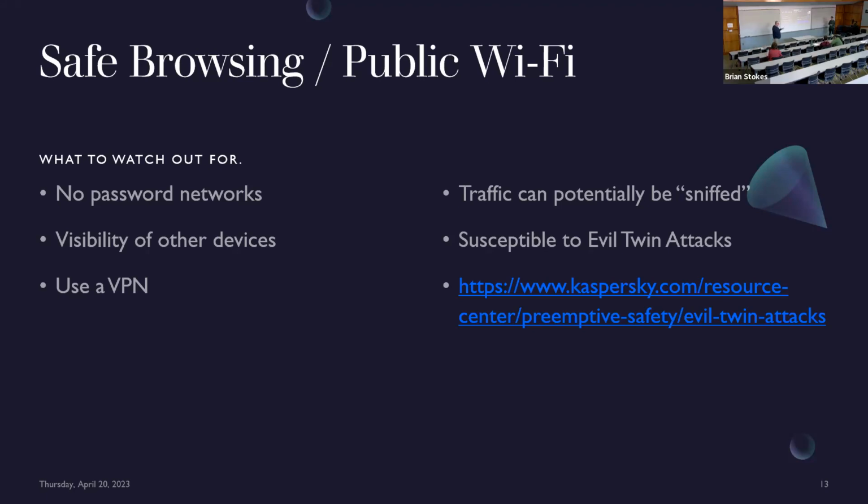Right, so if you look at a USB cable, you'll see four little copper things inside. Two of them are for power, two are for data. So the power-only cables will not pass any data through. But a lot of people carry cables, like the ones they got with their phone, that do power and data. And so that's where you get infected if you're not careful. Exactly. They're called data blockers. They're a couple bucks, and you can buy them online if you're really in a pinch and you want to be able to charge your devices.